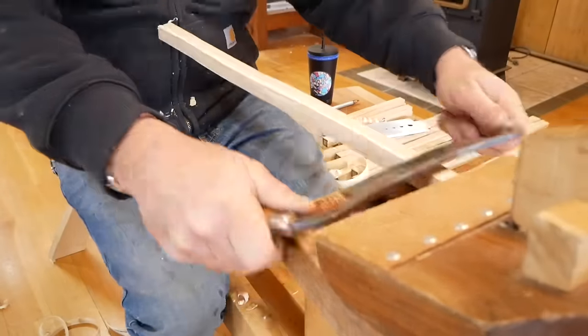There are also milestones when it comes to this, and Greg has us each hitting each one of those milestones. The grain direction is constantly changing — you've got to be conscientious that you don't get too much tear-out. If you get tear-out, you've got to come from the opposite direction. You've got to make sure you don't get so much tear-out that you can't fix it. But it seems everything's fixable. Following the destination lines that Greg has indicated, now it's time to cut the back off. We left the back square because we clamped it a lot while we were working on the front edge in and out of the vise.